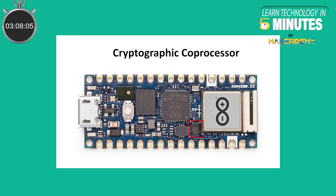The Microchip ATECC608A Cryptographic Coprocessor helps on the security side of things. It can securely store keys and assist in cryptographic algorithms like SHA-256 and AES-128. It also has a high-quality random number generator. Additionally, the board comes with a MEMS microphone for audio input, so external hardware isn't needed.